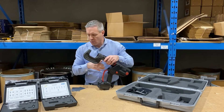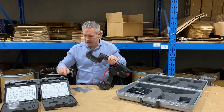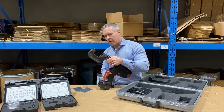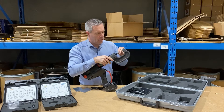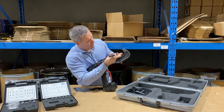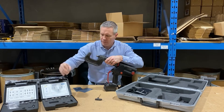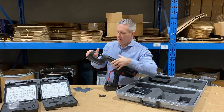I'm going to place one of the dies in here with the magnets and pop it into some aluminum. On the pin side you put the magnet fitting, and on the back side of the pin there's an Allen key slot — you just place that in there. There's an Allen key included in each of the die kits. You tighten that, and then on the other side you put the rivet die itself, depending on the die you need for the job. Slide that in and tighten the pin on that side to hold it in place.